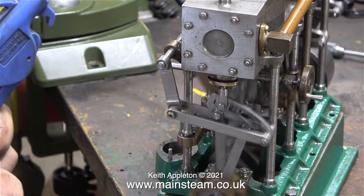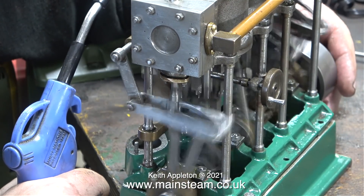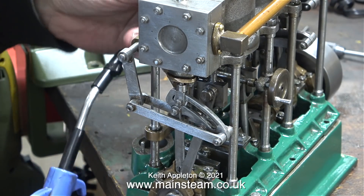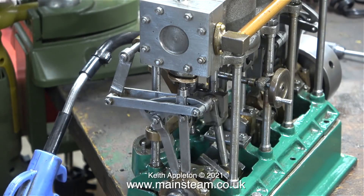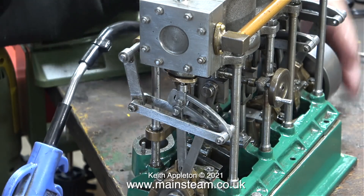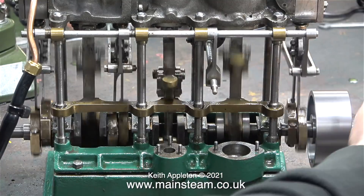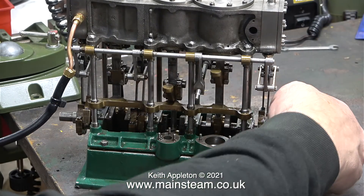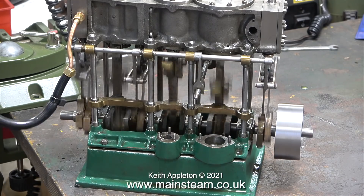This one is quite close but I think I can get it better than this. After another minor tweak it's running better all the time. You do need a fair bit of patience for this job, but I do find it's worth it in the end. Now the engine is running more or less the same in both directions — and not only can I hear that, I can see the waveforms in my video editor. It still seems to run marginally better in one direction than the other.